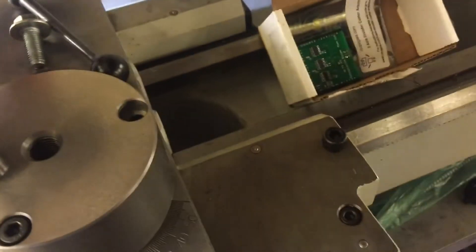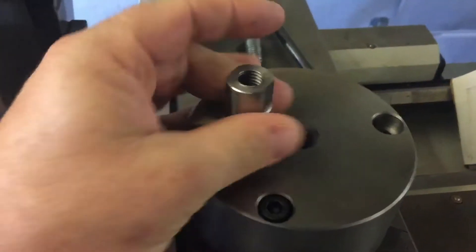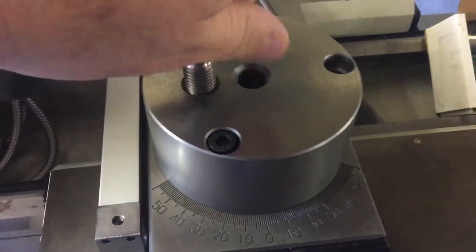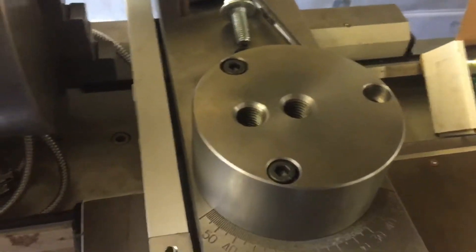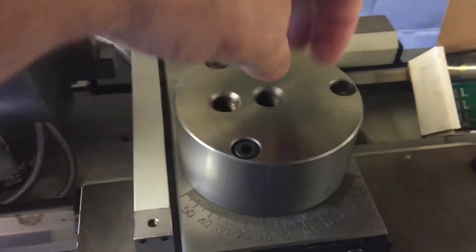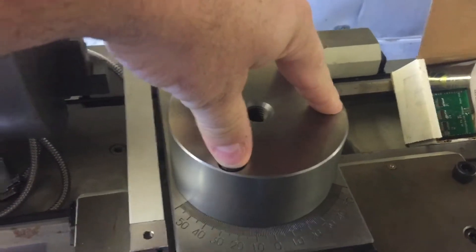It's not yet doweled in, but we'll dowel that in once I've got it tightened up. There's a pin here — 1080 or 1045 steel I think. There's a pin into the cast block — this is a cast iron block, and from here we have two 8mm bolts that lock in with a peg into the center of the tool post. I'll have to make another T-slot clamp for underneath here, so we have three points of clamping.